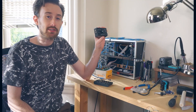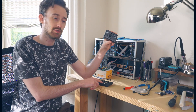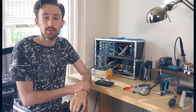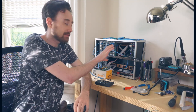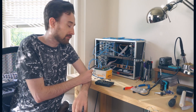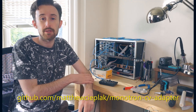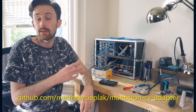Well, there you have it — a successful adaptation of Eurorack CV signals to Monotron-compatible voltages. With this, I'll be able to take my sequencer with me and program it on the go without having to haul a whole bunch of Eurorack gear in my carry-on. But I do think I need a portable power supply, because the one I have is just too big to bring, and the USB one I have only has a 12-volt rail — this works a whole lot better with dual rails so it can use op amps in their proper configuration. I'm going to post the schematics and the PCB layout up on my GitHub page if you want to build one yourself. It's very simple — if you have a Monotron and a Eurorack system, might as well give it a shot.